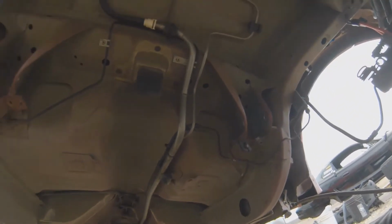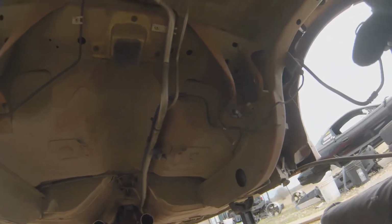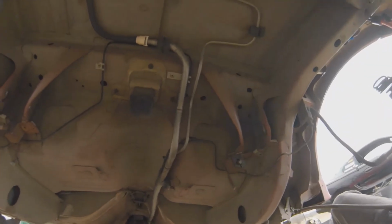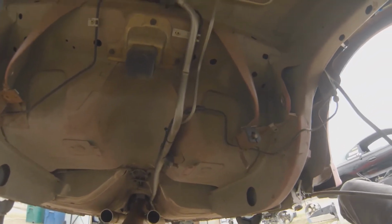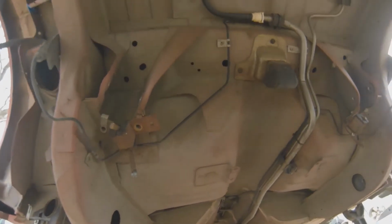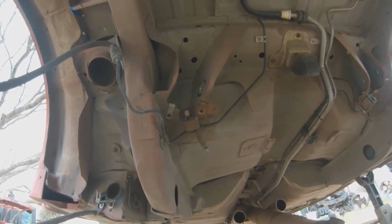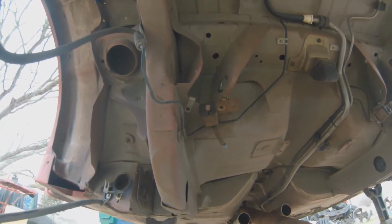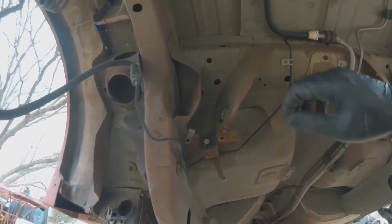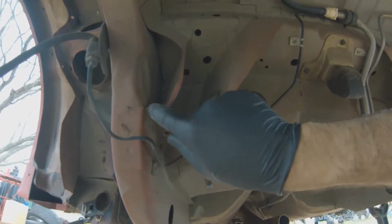You want to remove your back seat belt, pull this carpet back, and I usually get somebody to watch the inside of the car, because on the other side of this there is some of that undercoat. So either get a fan in there that blows a pretty good amount of air, that way if there's little fire starts it'll blow it out, or have somebody watch inside while you're doing this. So the same for here. Just get around anywhere that you can reach and weld those together.